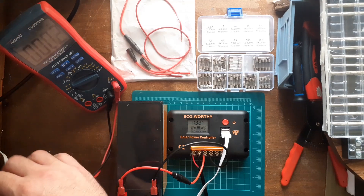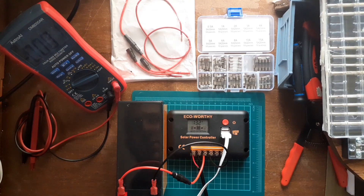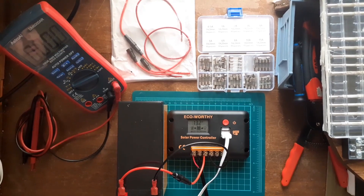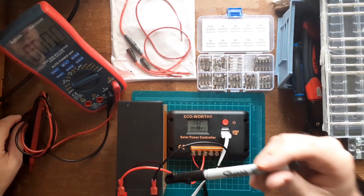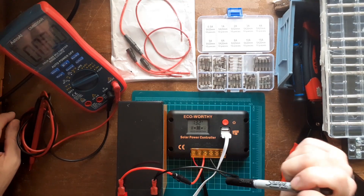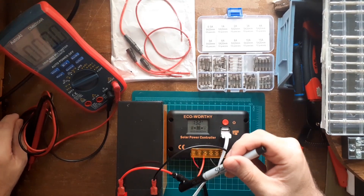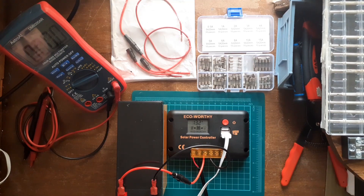If you have any questions or comments feel free to ask in the comment box below. This whole kit is quite inexpensive and it works well — I've been testing it for seven days with no issues. Always remember: don't cross the positive and negative on the solar panel or battery. Always add a fuse to the line — some units come with connectors that have no fuse, so I highly recommend adding an inline fuse just to be safe. If something does happen, it will blow the fuse to protect your system. Thanks for watching — if you enjoyed this video, please like, subscribe, and share. Have a great day.